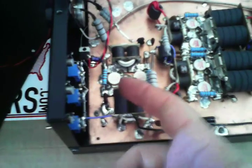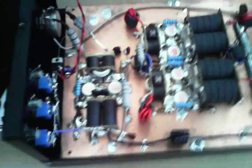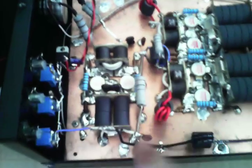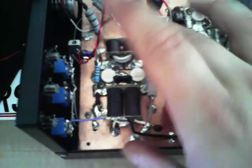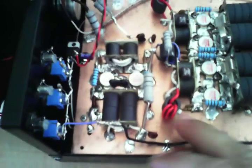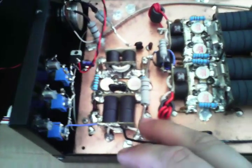Like I said, man, we got this good four gauge on here for you, soldered real well. I'm going to probably clean that flux off, maybe, just to kind of match everything else. Probably spent about two hours just cleaning this board, man — I took this 1,000 off and cleaned it up, put it back on. There's a few other odds and ends: there was just a wire going across here, and what I went ahead and did is just took that wire off and put a 5-watt 10-ohm right here. Kind of helped with the reflect a little bit — I noticed the reflect came down just a tad bit on the input, actually.